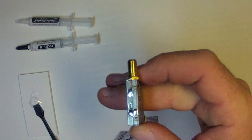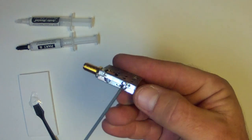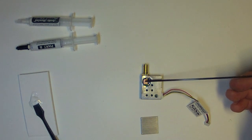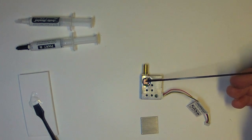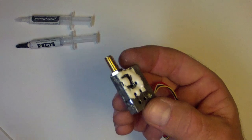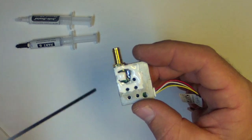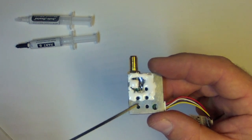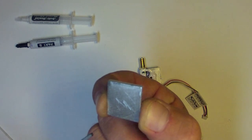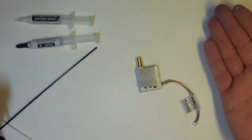For the final step, I've elected to apply some solder to the case to hold the halves shut — you could also use epoxy. Then I'm putting the two-part thermal epoxy directly over this heat sink and an additional amount along the sides where the heat sink will sit. Ensure there's a nice tall bead over the actual heat sink extender and a sufficient amount around it to adhere the heat sink to the case. The back of the heat sink should be extremely clean — sanded down and cleaned with alcohol, as should the case itself. Leave it alone for at least half an hour to harden and then you'll be good to go.